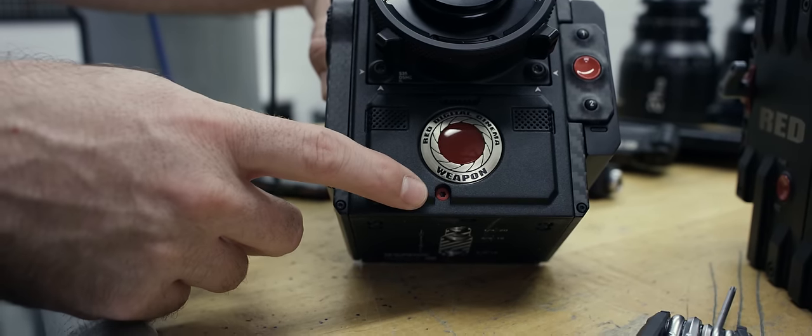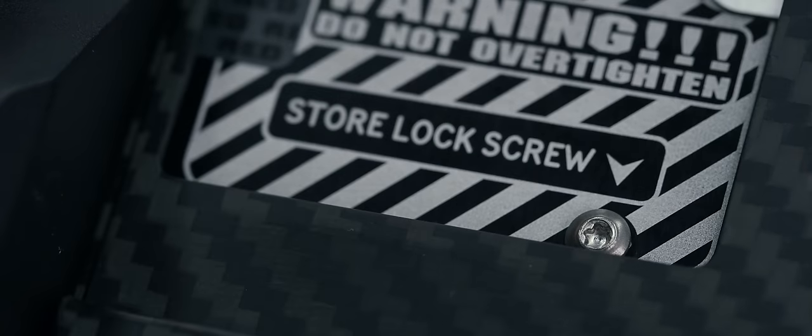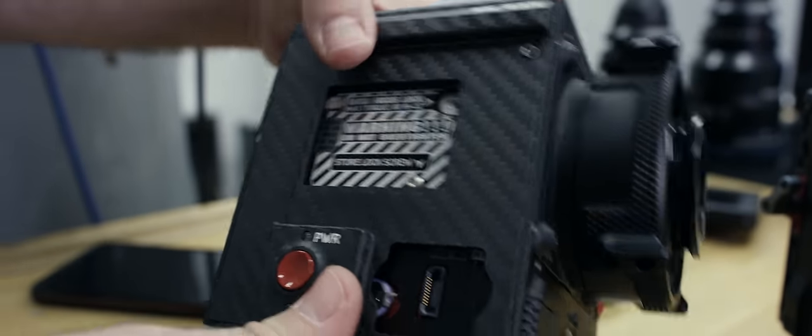Okay, this last thing — this is very important — back focus. We have a new SPM, which is a Sensor Positioning Mechanism. We've added the ability to physically lock the sensor into place, so the access point to adjust the back focus is now on the front at the bottom, versus on top before. Before you go ahead and make that adjustment, you need to remove the Sidekick and check to see if the bolt is in the locked or the stored position. If it's locked, loosen the bolt, remove the plug, make the necessary adjustments in the front of the camera, then re-tighten the bolt. We've made the caps red, and a lot of rental houses are adding their own indication as to whether or not a sensor is locked.